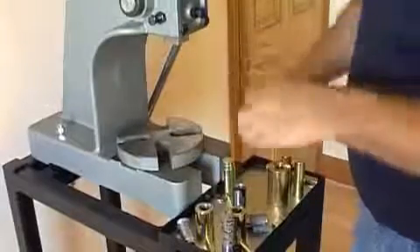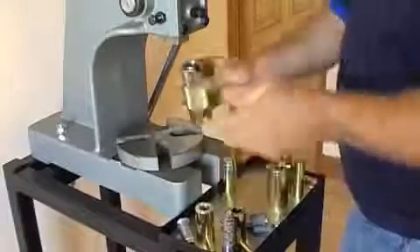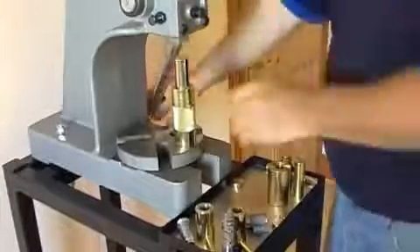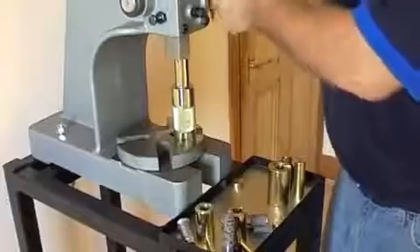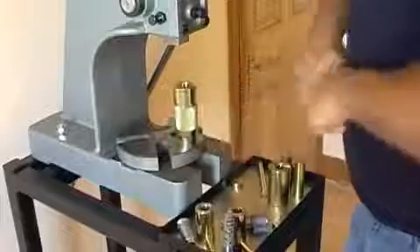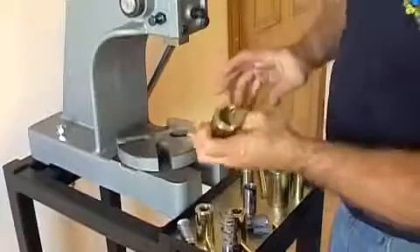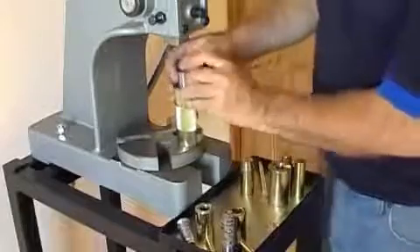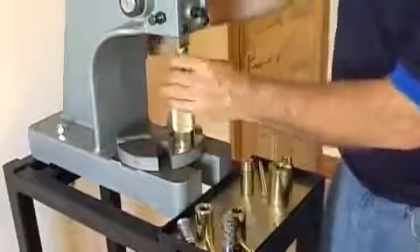You need to straighten the canister: move to spacer 2B, insert the canister and the straightening fixture. Use the straightening tool, knock it out, turn it round a bit, and make sure everything is perfectly straight. At this point I always change back to spacer 2A, assemble, and press everything home. Make sure it looks good.